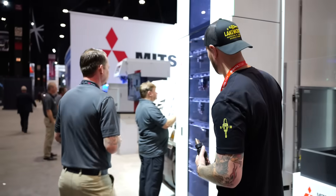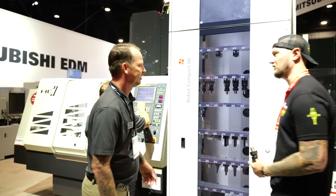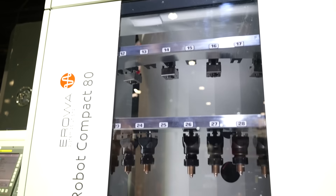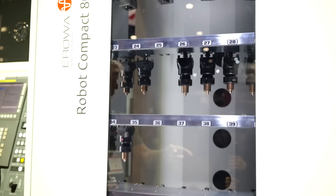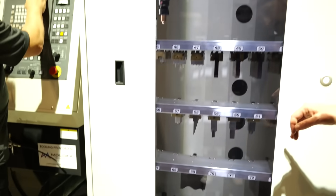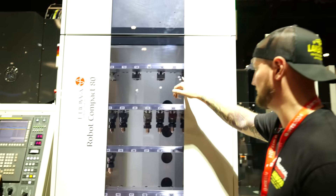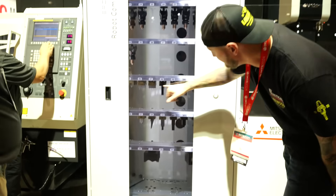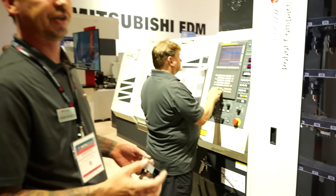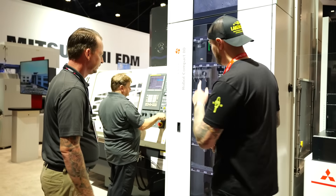I wanted to take a look in here — this is the automation option. Like I said, you're making the ammo — there's literally a bunch of them ready to go. We machined all those earlier and then we pick them up. We have our parts up here on the top, and with this robot it'll actually articulate so we can load a chuck on the table over there as well as on either machine — it'll feed both machines. There are also 106 tool locations on here. So you can have the work pieces up here, the dies down here, different jobs all staged — this is how you'd set it up to run through a weekend or a long haul. We could have five different jobs in there with material ready to go.